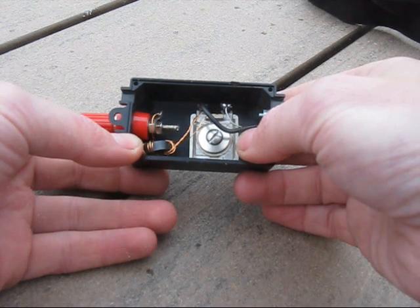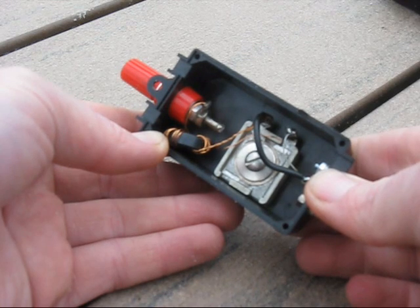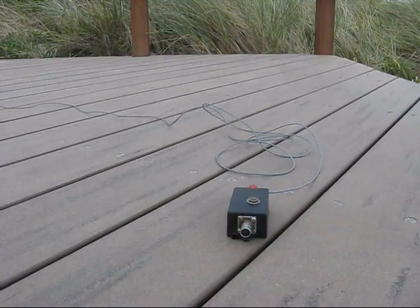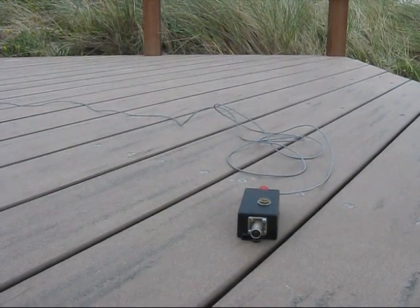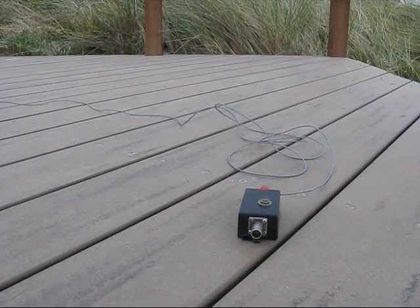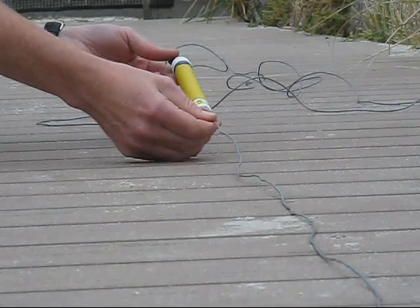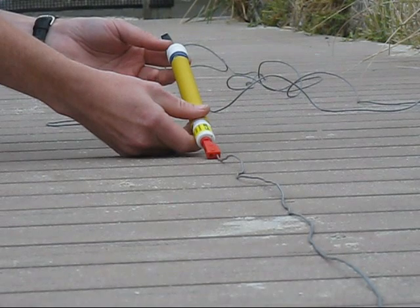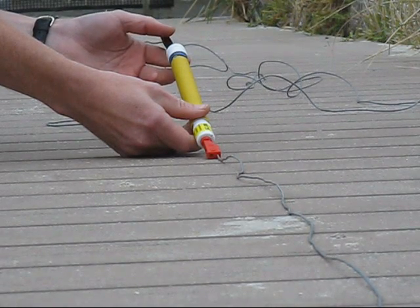The compression trimmer capacitor goes up to maybe 400 or 500 pF. The trimmer capacitor is set for lowest SWR on 10 metres and then left alone. Here's the antenna laid out along the deck. At the bottom of the half-wave section on 20 metres — about 10 metres long — is the matching unit. At the top of the 10-metre section is a loading coil and a short tail, used on 40 metres only. They make the antenna a loaded half-wave vertical on 7 MHz.